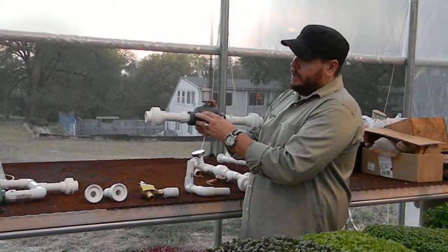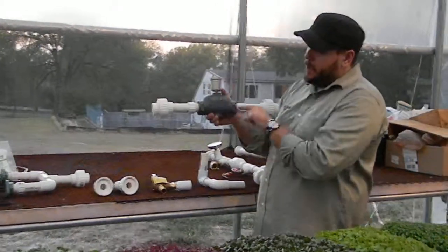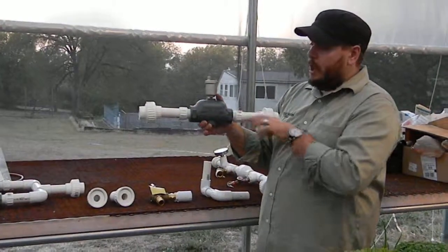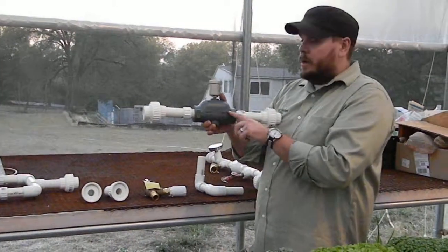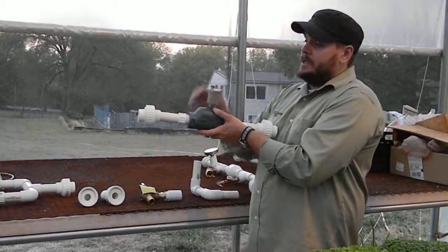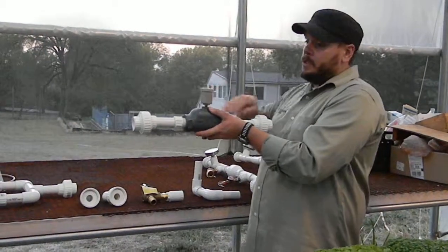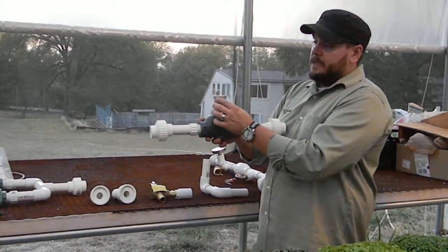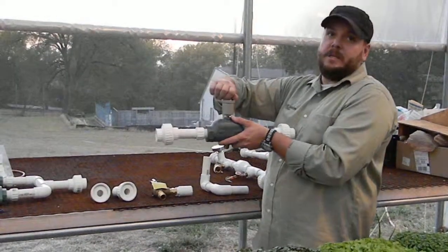This big box right here, basically air needs to be upright. The air will go through this system, and it's got a little bump out on the top. As water's going through it, any air that's in the water has a tendency to collect on the top, and then there's an air vent on the top of this system. So as the water's going through, air will collect in this little bump out on the top, and this air vent allows us to open this as we need to.